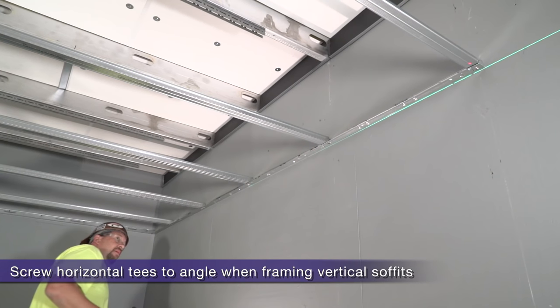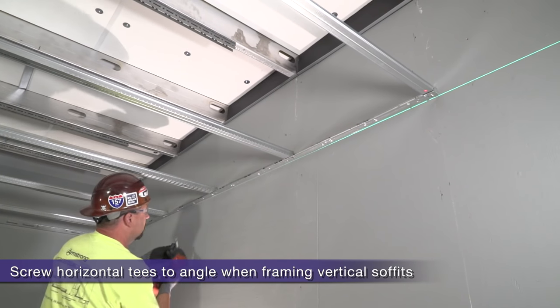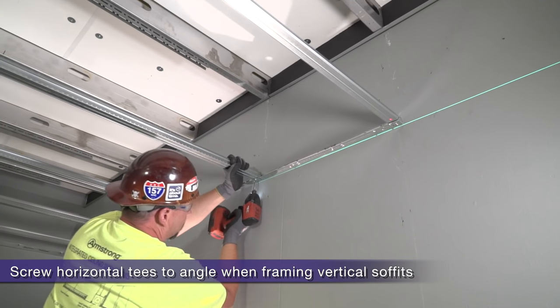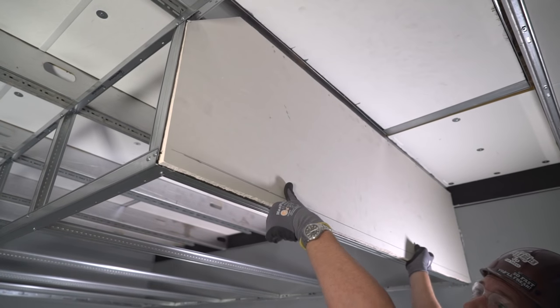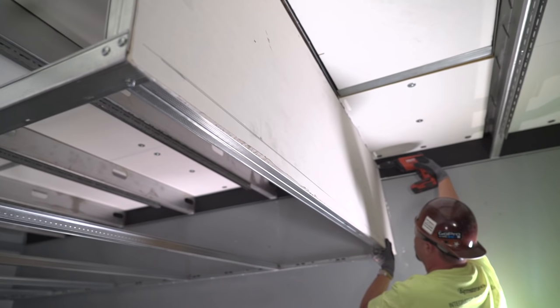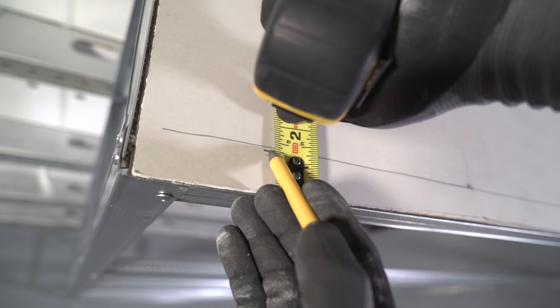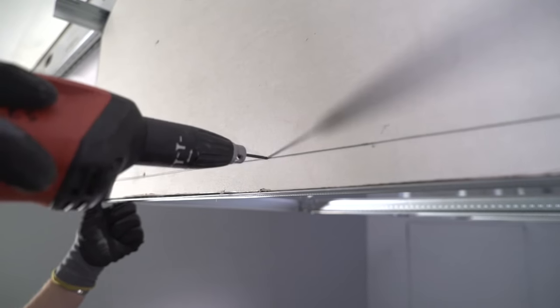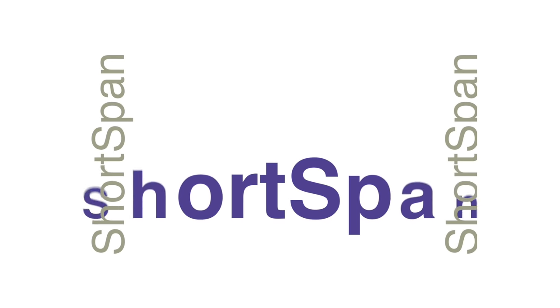If the soffit is not tied to another wall and just returns vertically, you will need to screw attach the horizontal Short Span to the wall to eliminate pull-out at the locking tabs. The best kept secret of Short Span and all drywall grid is that half of a tee is 5/8 of an inch — therefore 5/8 inch drywall tucks perfectly into the open ends of soffits to fill the void. When securing your drywall to the Short Span tee, make sure to place your screws through the bulb of the Short Span — a reference line makes this easy. Ready to get started? What can you build with Short Span?